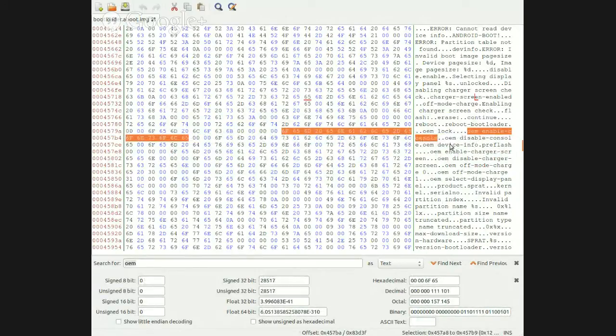Alright, so I'm going to get this thing kind of back together and do a fastboot OEM enable console, because that seems like what we need right now. If we can get a console on this thing, especially if it's a root console, that would be helpful. I hope it is, but yeah. Well, a lot of the times, what they do on these devices is they will disable most of the OEM functions, all the useful ones that, you know, we find useful at least, and you end up with a device that just isn't that much fun to play with.